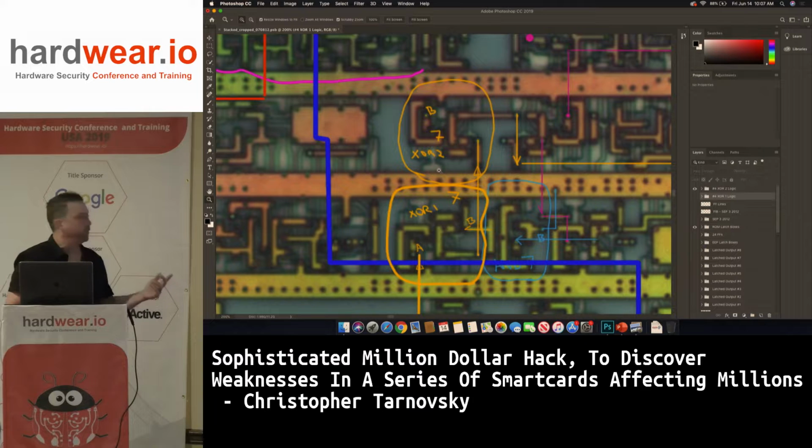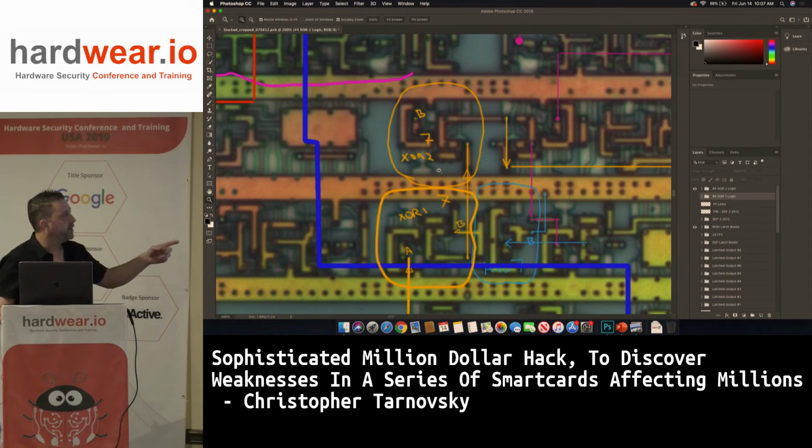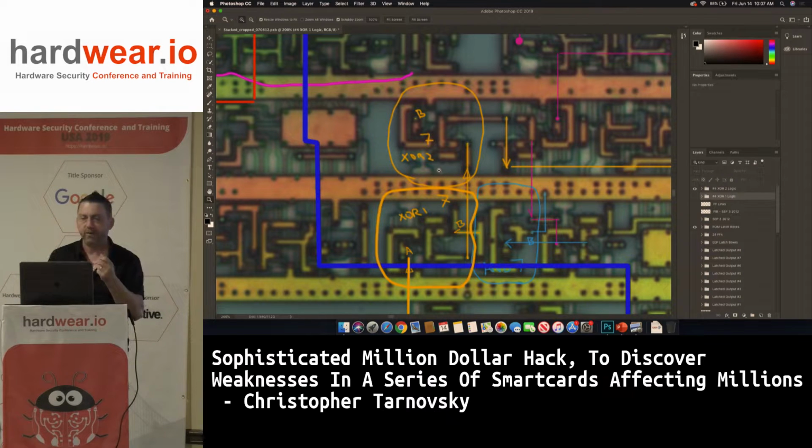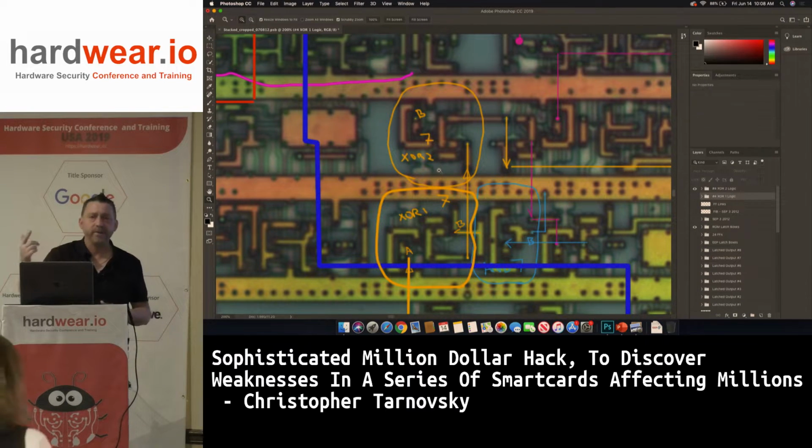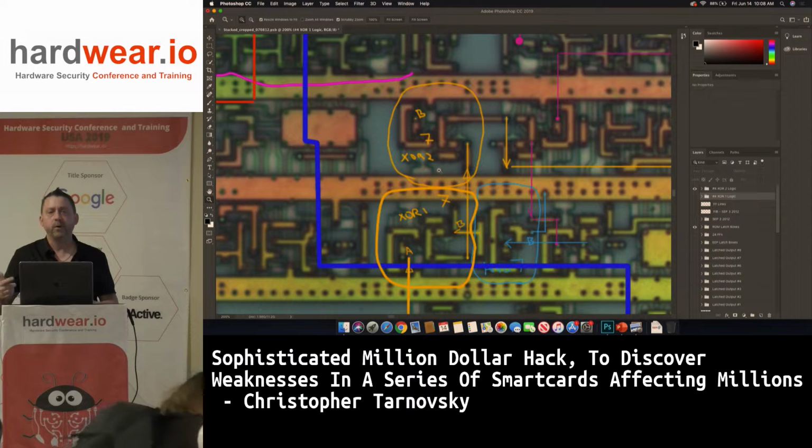But ST did something really cool. ST decrypts with XOR 1, the fetch. There are 8 XORs, because it's an 8-bit data bus on this particular chip. On their newer chips, they went to a 16-bit data bus. On the ST23s, which are 90 nanometers, I showed a snapshot of it yesterday. Oliver Thomas and I, with Oliver Kummerling, did some work on the ST23. When was that? Back in like 2009?